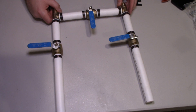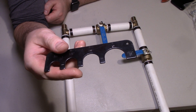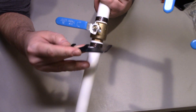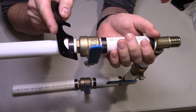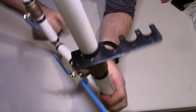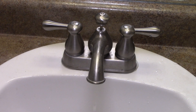There is a check tool — also called a go/no-go gauge — that you use to verify the crimp. Depending on pipe size, you place it on the copper fitting you just crimped. It should line up with the line across the top of the tool. If it goes all the way against the edge, you've crimped it too tight. If it doesn't fit at all, it's not tight enough. If you don't do it properly, it will either leak or you will damage the brass fitting or the pipe.